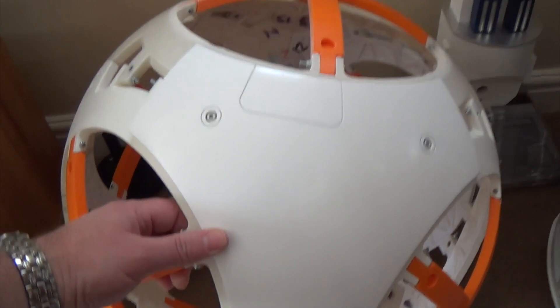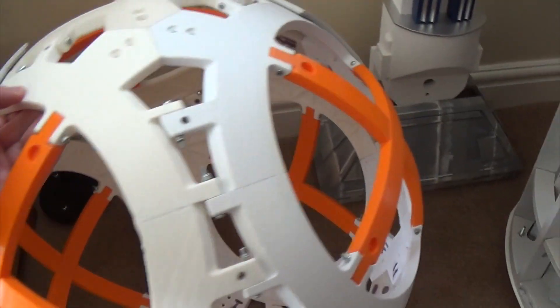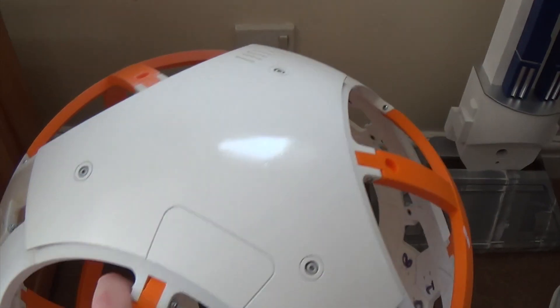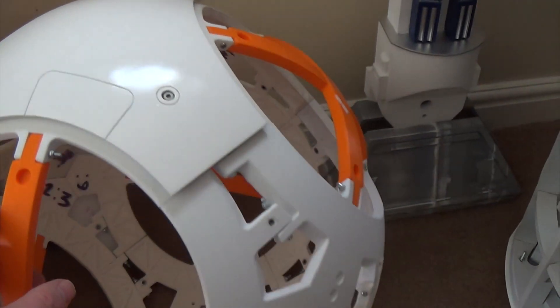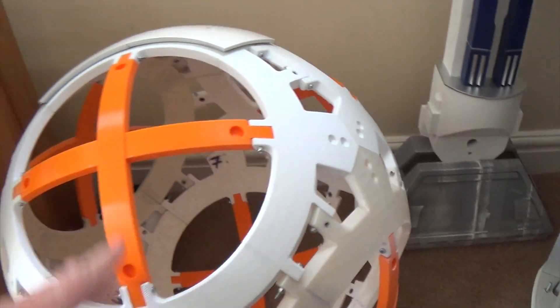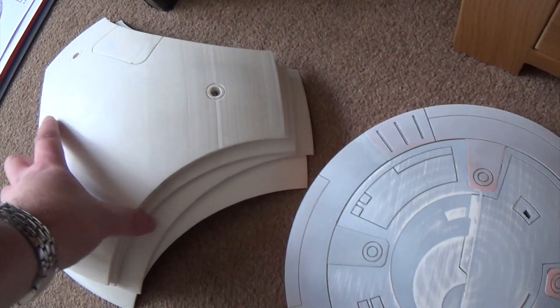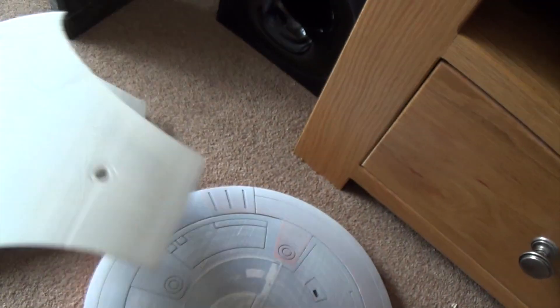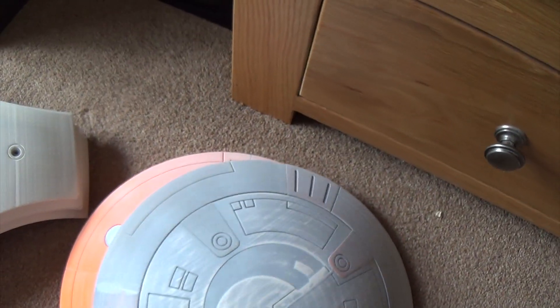It's the 6th of July 2016, update on BB-8. I've got a couple of triangle panels with some top coat on and they're looking quite nice, but I can still see some grain where you can see the layers from the 3D printer. I'd like to get it a bit better. I've done quite a few rubs down and a few layers of primer already, but I've just bought some filler primer to help fill these little scratches and trenches.